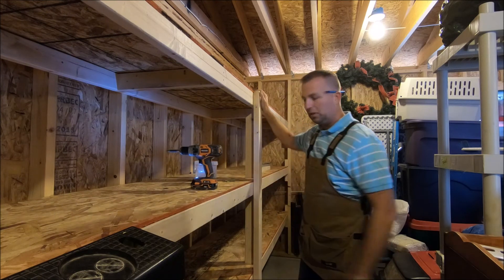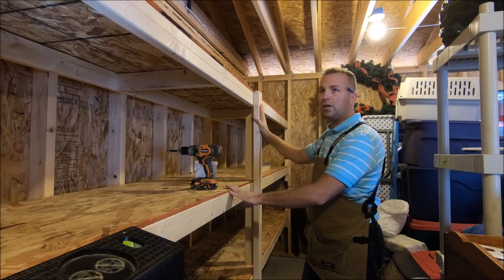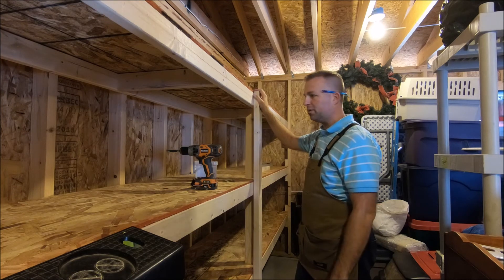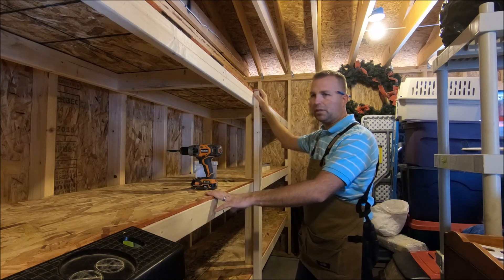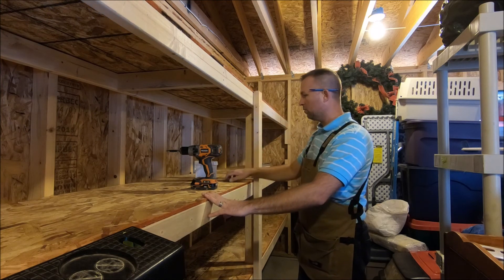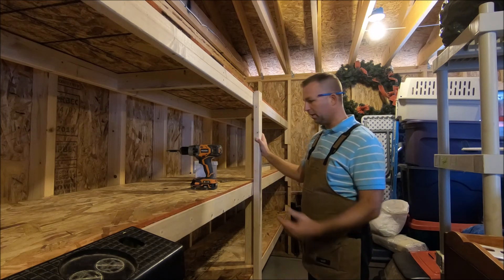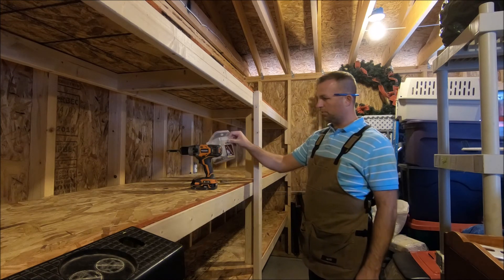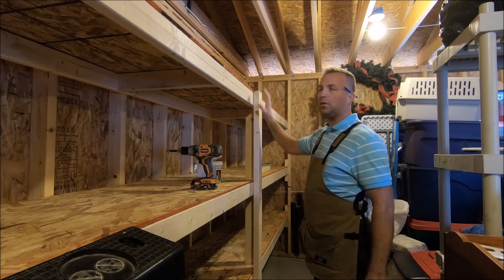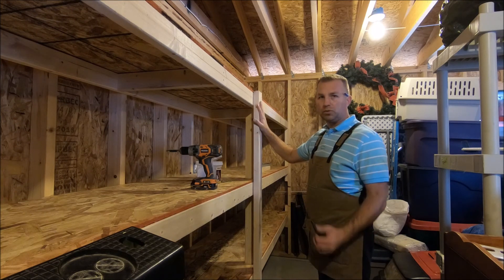I'm going to go get my mom — she can hold this stuff up. So that's it, pretty easy. I think it's about $100 worth of stuff right here. You can probably have most of it cut. These are six-footers, assuming you're going to do a two-foot shelf just like here, which is pretty standard — these totes fit really nice on it. Have the pieces cut in half lengthwise, and if you're going to do 12 feet you'll need to cut two or three four-footers for the total shelves. If you like this video, subscribe and click on the notifications, like the video. I'll link some of the stuff in the description — the screws from Home Depot and all the wood, which is just two-by-fours, and the plywood is roofing plywood, OSB. Subscribe and we'll see you in the next video, thanks for watching.